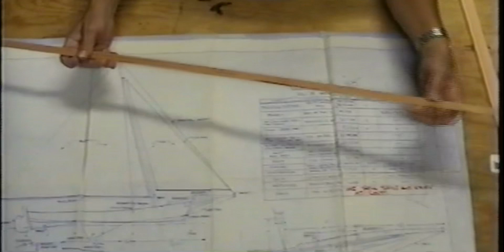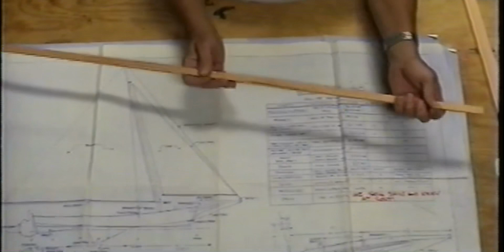And in the places where the board had to do a whole lot of bending and bowing to relieve some of the stress, we made a little saw kerf in the wood, which allowed the wood to bend and not be under a lot of stress. To reinforce that, we filled all those saw kerfs with the waterproof glue that we used on the whole boat, to give it strength.